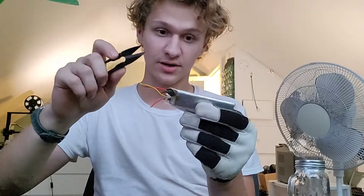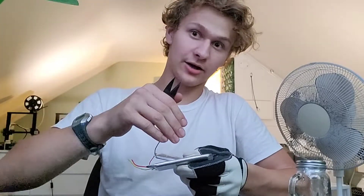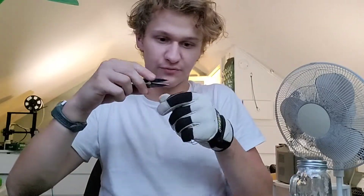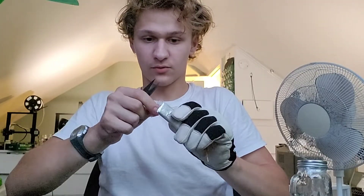It is dangerous. The reason it's dangerous is because if you puncture it, the positive and the negative short out creating a fire. It could combust when air comes in — it also reacts with lithium — so while it sparks and smokes it also makes fire. These batteries are deflated because I've poked holes in them; they were a little inflated before. So now that I've deflated them, I know they're not going to explode.